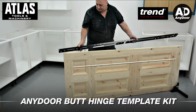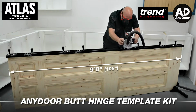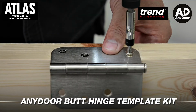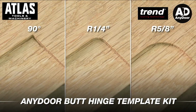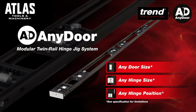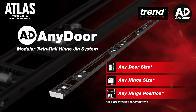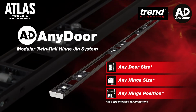The Trend Anydoor butt hinge template kit is designed to hang any door up to 9 feet high and 1 3/8 to 2.5 inches thick, using a modular design that allows square, 1/4 inch and 5/8 inch radius hinges to be fitted anywhere along the door edge. Fast assembly and adjustments allow the Anydoor to fit doors to high-quality professional standards with precision, speed, and ease.